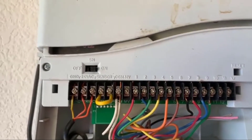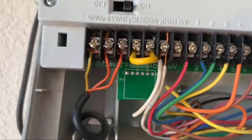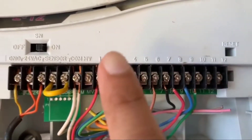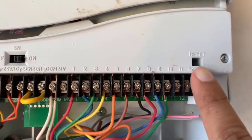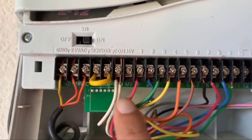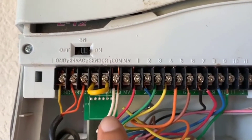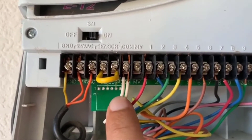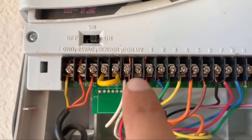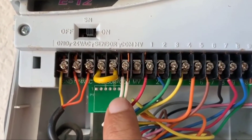Notice the existing wiring. There is a power input coming in from the power outlet, connected onto these three cables. Then zones 1 through 12 or 16 — whatever number you have — these are the cables connected to each of those. And then there are a couple of white wires — these are the common wires. On the new controller, there are three or four common connections where you can insert these into any of those COM connectors.